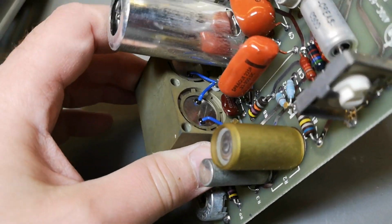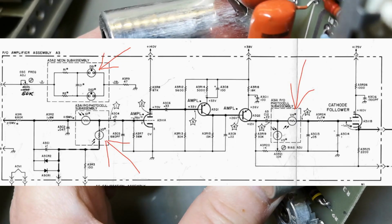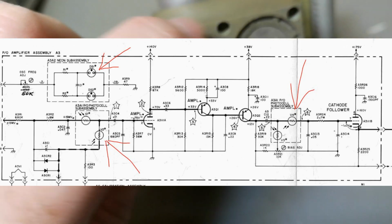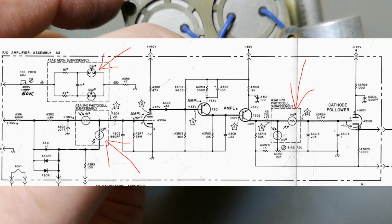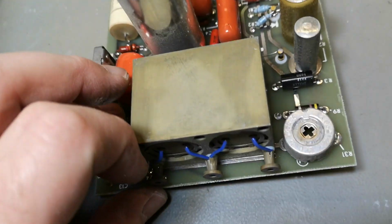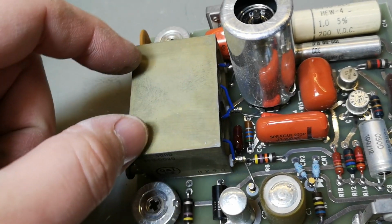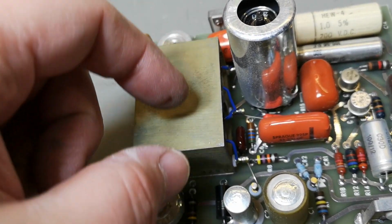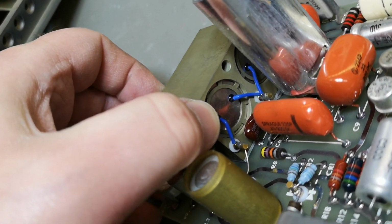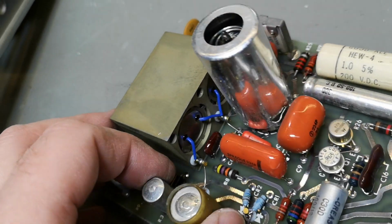And I did consult the schematics a little bit. And look at those 4 blue wires. And then again 4 blue wires in each of these rooms. And they're connected to a single center point. So that will be the photoresistors. That's in here. And the other photoresistors. So you got 4 photoresistors, 2 and 2, working in alternating mode for the chopper. Of course, on the input, and the output is in synchronous operation, of course.